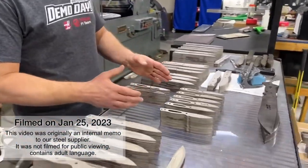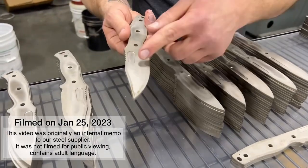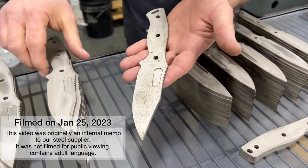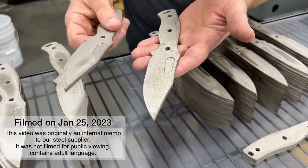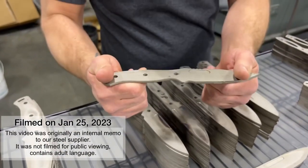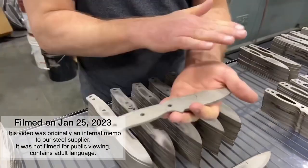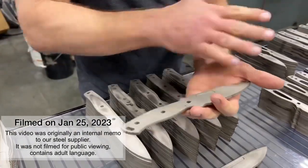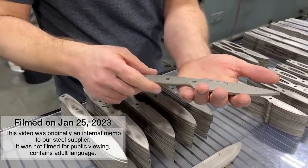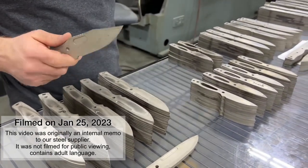The smaller parts are really warped, and the decarburization is really random. Where these parts are heavily decarbed — this one was at the end of a stack — they're really, really badly warped. As you get smaller, I've got less magnetic hold-down power. I need to be able to get these somewhat flat to normalize side one, get through all of that, get through all the waviness, the cupped aspect of it, the twisting as much as possible, and then flip it and bring it down, and then I get it to where I can actually flatten it.